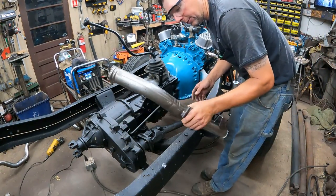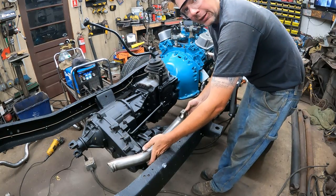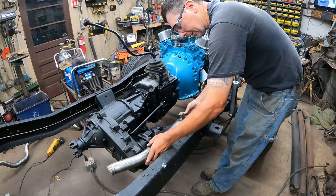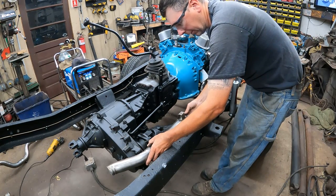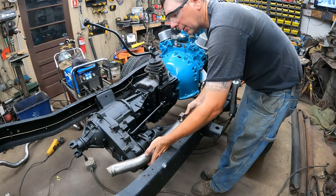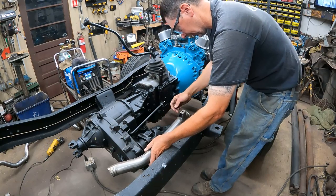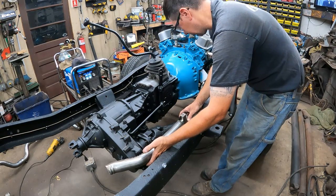So if I do that double bend, then I've got this piece that I cut off the pipe. If I can go straight out of the converter-ish, and then I've got this bend here to get around the transfer case. Get over here near the cross member. Something like that. I don't know how close this is to the floor. I don't want to get it too high. Well, actually, exhaust came through here anyways, factory. So get it like that. Use that kick to get it around the transfer case. And then right back out of there. That looks like it's going to work out pretty good. So I just got to, up here, put the converter right here. I could probably cut the pipe right here, take this flange off, have the converter start there. Use this kick. Man, that looks like it's going to work out good.